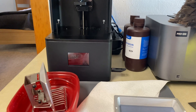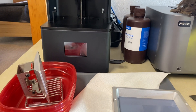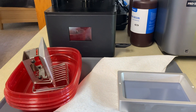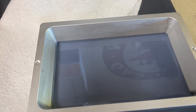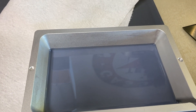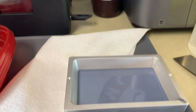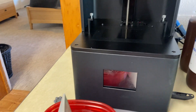I initially thought it was just a standard failure to stick to the build plate, but no. After that I ran my vat cleaning coupon — just a rectangle that I expose for about 10 layers to collect any trash in the bottom of the vat that you can peel out. When I went to peel it out there was nothing in there, and that's when I realized this was not what I thought it was. So the first thing I did was pull the vat out and ran a test print just to check the LCD.